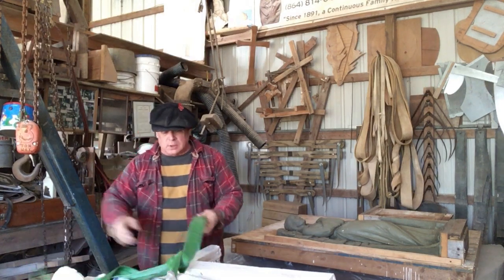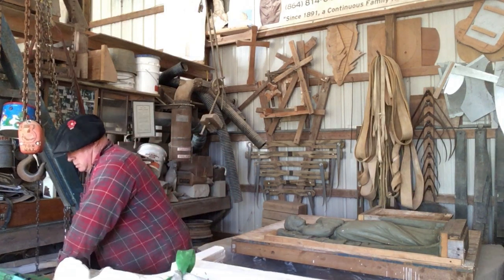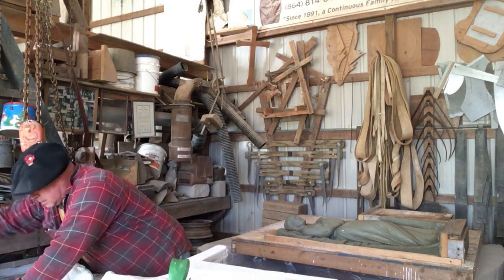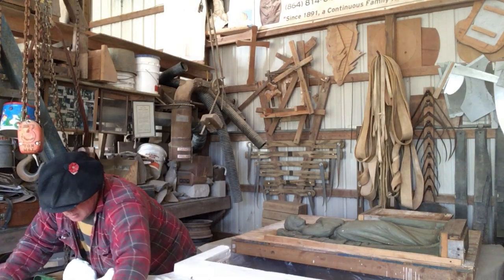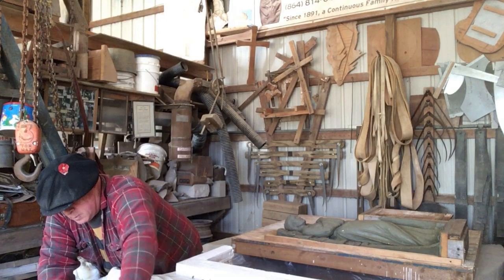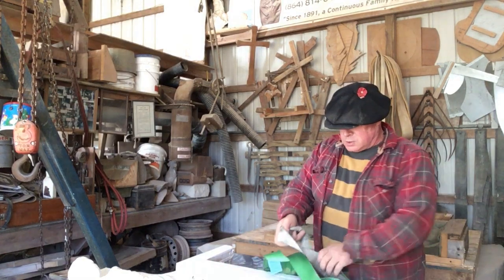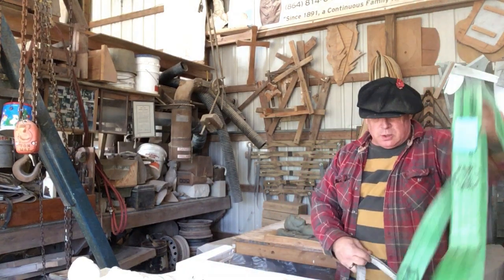Important to keep straps clean. It helps them from potentially fatiguing because you don't necessarily know if something's good or bad on a belt. So keep them clean. And they usually have abrasion issues. Where they've got fibers that show once they get abraded to a certain point, you're not supposed to use them. They won't pass the insurance or certification.